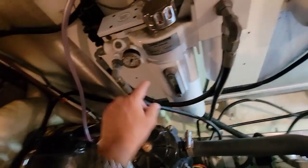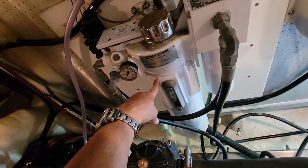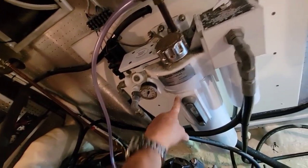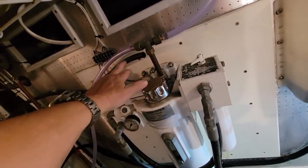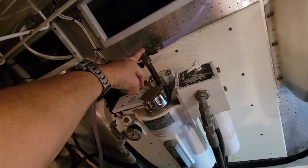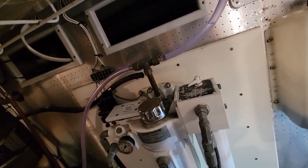This heat exchanger built into the thing is pretty small — only needs about three to five gallons per minute flow. So I can't use any kind of heavy-duty pump or air pressure to try to clear it out. In troubleshooting this, I first disconnected the cooling hoses and tried blowing through the circuit. It was hard to blow through, so it's somewhat clogged — a little bit of air is getting through but not much. That's why I'm flushing that system out.